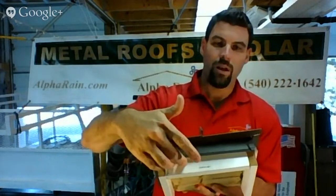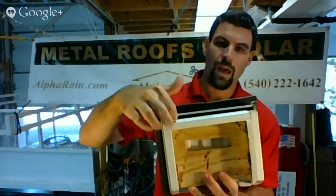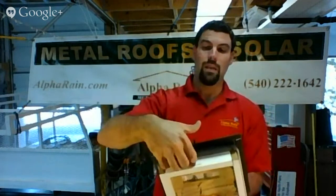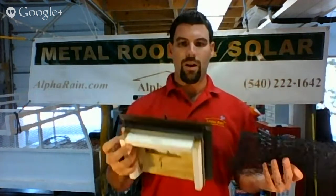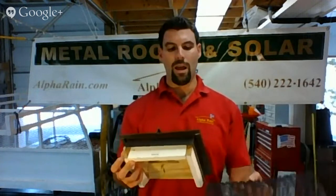You'll get a full picture of how it works versus just short clips. Basically, you can see there's a gap here — this is the drip edge, and this is your fascia. There's a gap here and we allow air to go in. We have a mesh — the mesh actually goes underneath here and it keeps bugs out, and it also keeps just a small space for the air to be able to go underneath the roof.